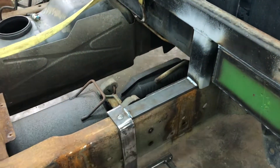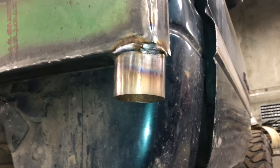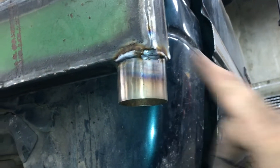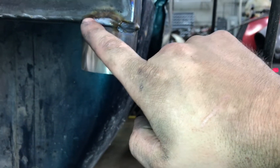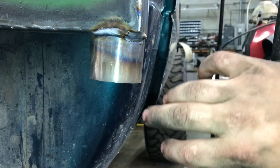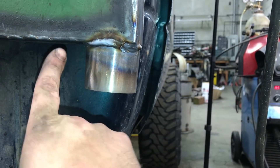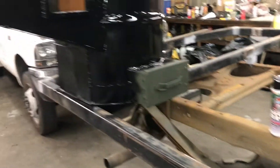This is going to encapsulate it just fine. For the hopper drain, I've got just a piece of two-inch pipe and I knocked out an inch-and-three-quarter hole inside. I'm gonna go back in with a carbide burr and clean it up. It looks like it's sitting crooked but I actually intended for that — I wanted it to kind of follow the body line just a little bit. Also, because the tar tank is sloped this way, it kind of levels out with this being just a little bit tilted. I gotta wait until the bed comes off for the last time to weld the back side because I can't get the welder into that gap.